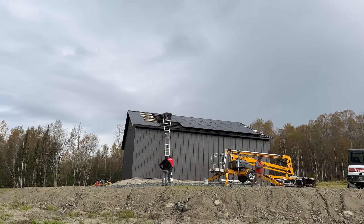Just finishing up the third string of panels. It's starting to rain unfortunately, but the sun's out. We're going to be able to finish up our rails — we're going to cut six of them at 48 and three-quarters of an inch. I'm going to get my wires done up here, then we can get off the roof. Hopefully it stops and then we can finish up. We have seven more panels to do once we get these rails made. They're aluminum, so cutting them with a cutoff wheel isn't going to be fun, and a sawzall would work but also not be fun, so I get to use the bandsaw — that should work pretty slick.